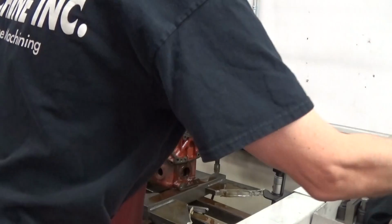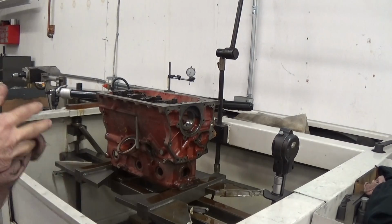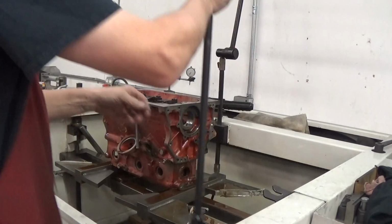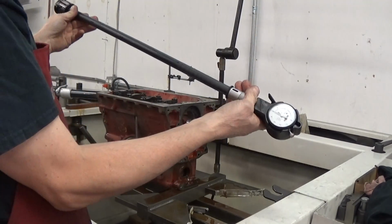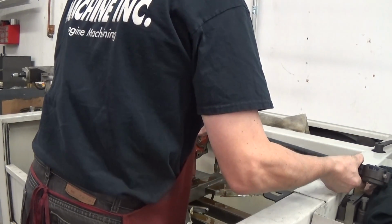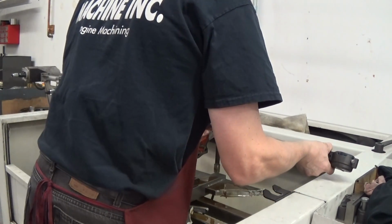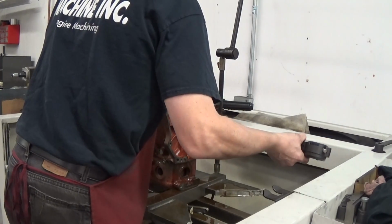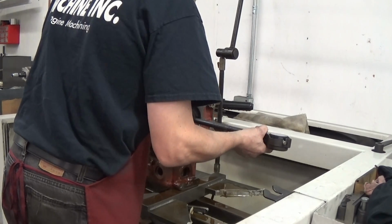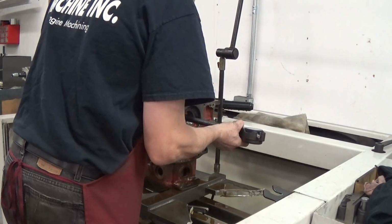Now you probably heard the motor wasn't bogging down or dragging, trying to correct an out-of-round situation, because the bores are nice and round because I've previously line bored it. So here I have another Sunnen bore gauge, the 24-inch version for reaching down into main lines. We just check our progress as we go. Okay, we got 7/10, 6/10, 6/10, 5/10, and 7/10.